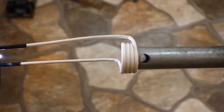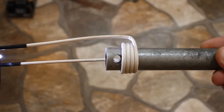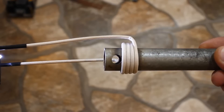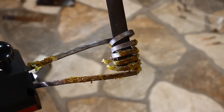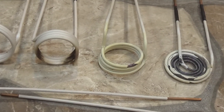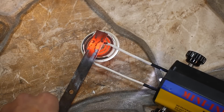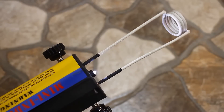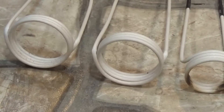For effective heating, choose an inductor that is optimal for the diameter of the workpiece. The smaller the distance from the edges of the workpiece to the inductor coil, the higher the efficiency. But under no circumstances should the workpiece make contact with the inductor coils, especially if the insulation is damaged. In practice, the inductor coils have accidentally made contact with the workpiece multiple times and the heater was not damaged. Remember that inductors do not have forced water cooling — do not run continuously for more than two minutes. After every two minutes of operation, take a break for a few minutes. Do not turn on the heater when the inductor is empty without a workpiece, but even if you do, nothing serious will happen — it will just lead to self-heating of the inductor.